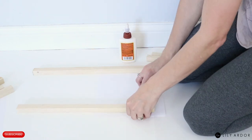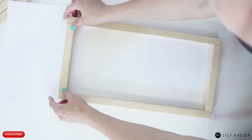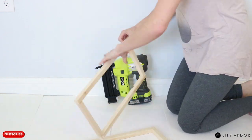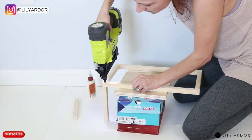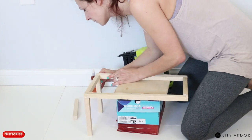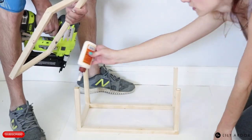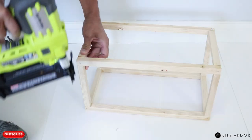To begin, you'll start by gluing your dowels together. I glued my dowels to create a rectangle, and let the glue dry a bit before using my brad nailer to secure it. Since I was creating a box I made two rectangle frames exactly the same, then connected them to the other dowels creating a box. I didn't have any clamps so I had to use random props, but my awesome hubby jumped in to help. It definitely helps to have an extra set of hands for these steps.